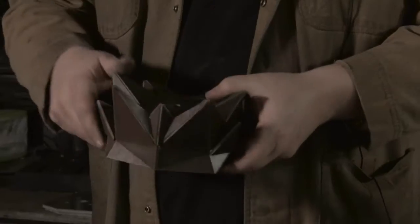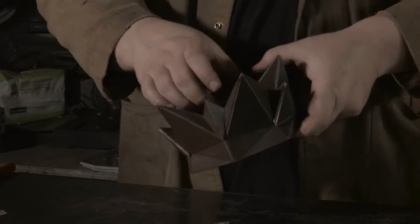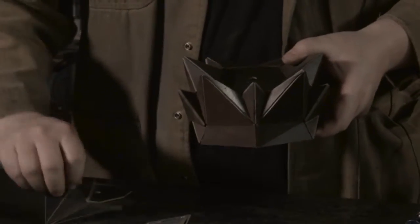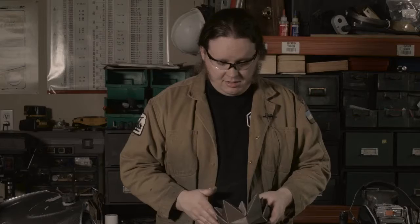For example, we have a top plate like that, which goes on there, and we have two back pieces. So, how do we hold them all together relative to each other so that they all fit? And I played around with a lot of solutions, most of them terrible, and finally I realized I could just 3D print an external jig. And I have a set of them here for the whole process. I've been using them a lot, so they're kind of ugly and burned from the welds, but they work.